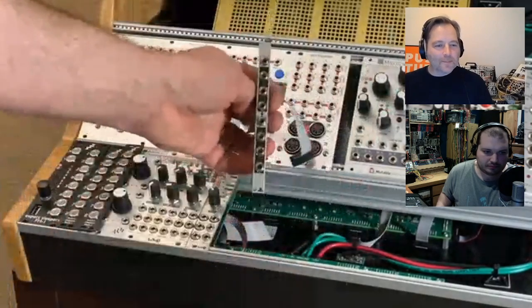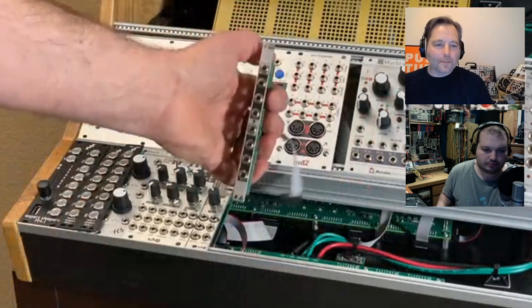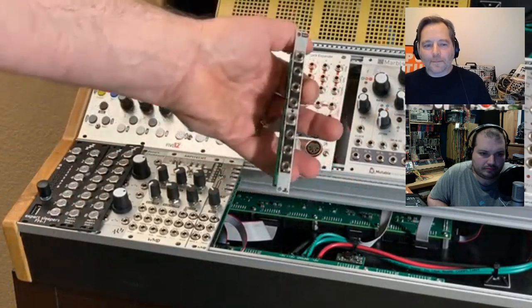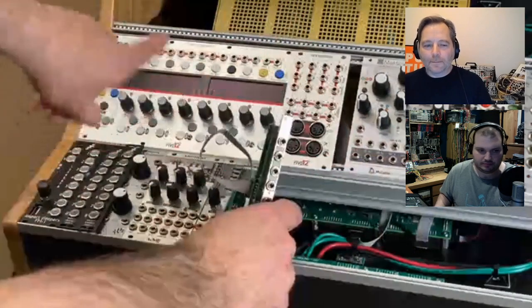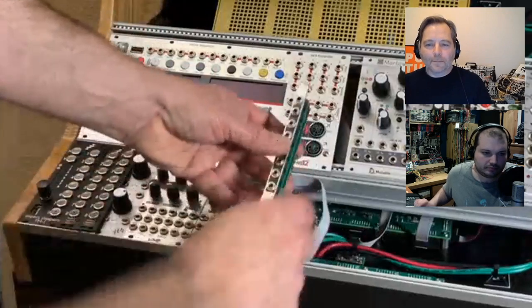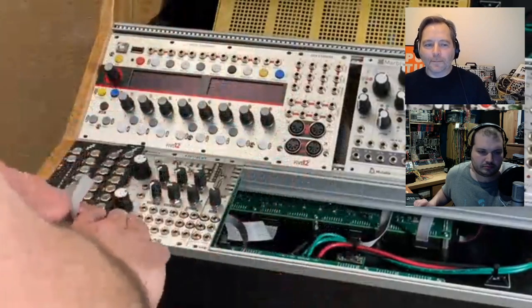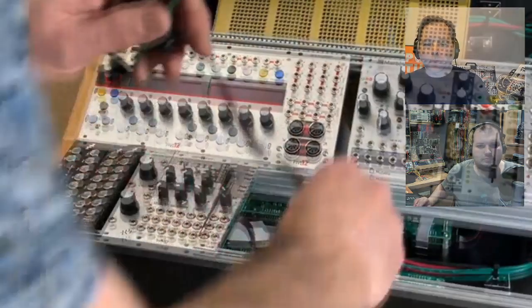We were talking about buffered mults earlier. Mults are another thing throughout your system. I put buffered mults by my oscillators because that's what needs them the most. And frankly, I just use splitter cables for anything other than pitch to CV stuff because I don't want to take up module space. You'll see when we get to oscillators, I've got a system of how I distribute my voltages to all my oscillators, but I'm throwing a spare buffered mult module in here. In this case, it's an Intellijel BM next to the arpeggiator and the note outputs just so I can split off some voltages right here.